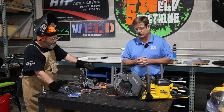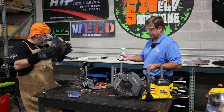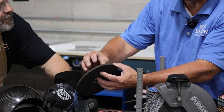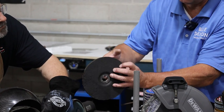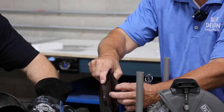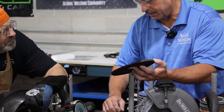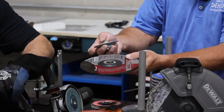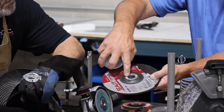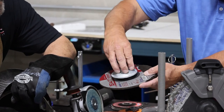Here's a cross section of a United Abrasives seven-inch wheel. You can tell we use the same grit pattern throughout the whole wheel — it's not a fine hard back with 24 grit on the bottom and 60 or 80 grit on the top. We actually use four layers of fiberglass in here. The fiberglass is what protects you from the wheel falling apart. A lot of our competitors only use two or three layers, and the fiberglass is actually the most expensive part of the wheel.